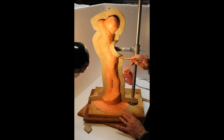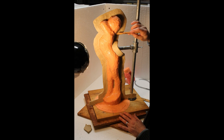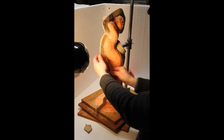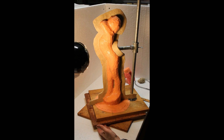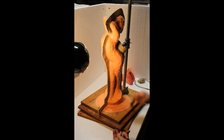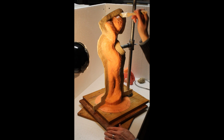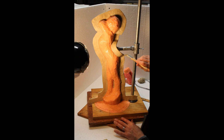I'm just finishing the little pinching there and I've got my wood tool. What I'm doing is forcing a little bit of that clay at the bottom up against the surface — sealing it so that when I apply plaster, I don't have a lot of bleed under. At least this way I'm going to have a clean edge, a nice parting line. You can see how I drove a wall out on the base too, because the plaster will flood down and I want to make sure it's not going to roll behind the sculpture.